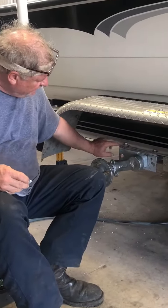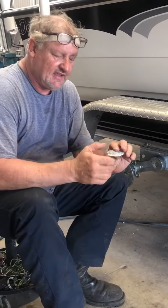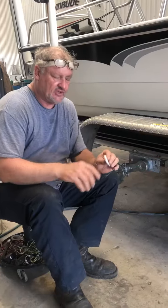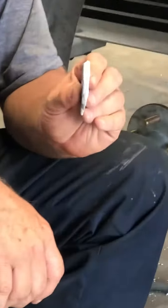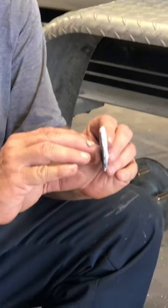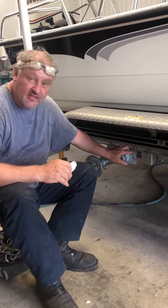When we took the original off, it didn't have that aluminum spacer in between — it had this: just axle to frame. Look at the corrosion that built up in between there. It's about three-eighths of an inch of corrosion that got in there and pushed the two surfaces apart — it actually pushed the frame away from the axle.